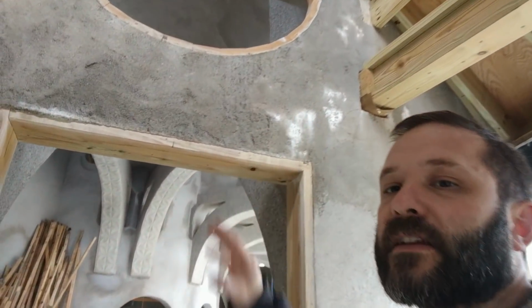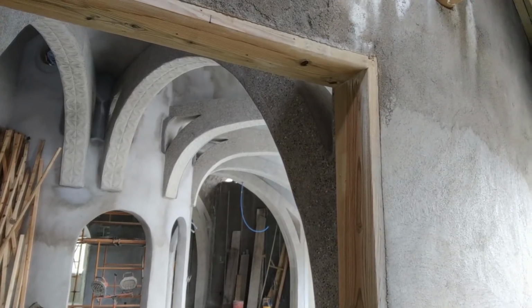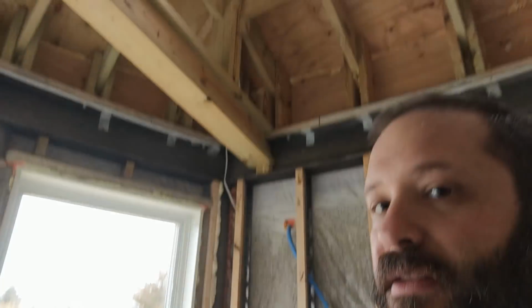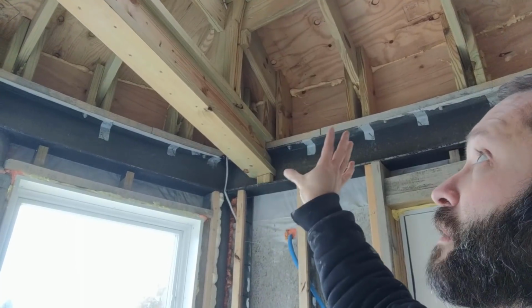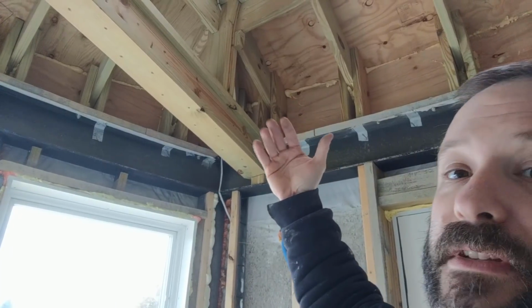we'll end up insulating all this room. I'm actually working on that insulation job right now. There'll be about 7 inches of insulation in these walls. And then the ceiling part, I'm going to spray foam that, the spray insulation, but not until I've got the roofing on, because I want the nails to come through first and then I'll spray it.